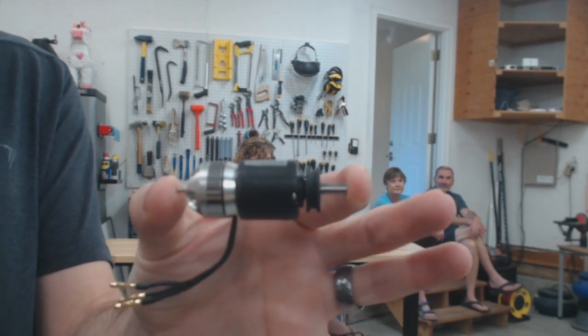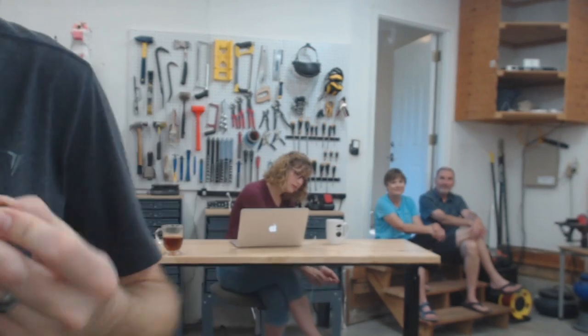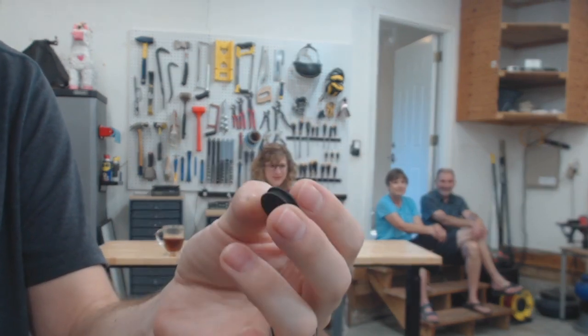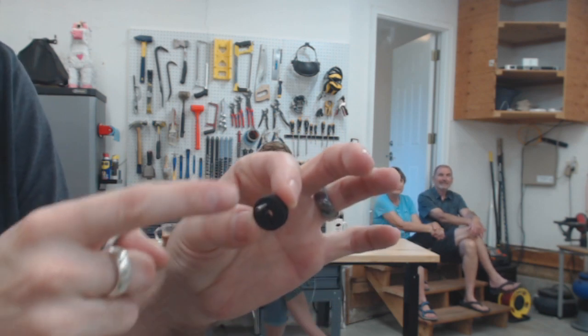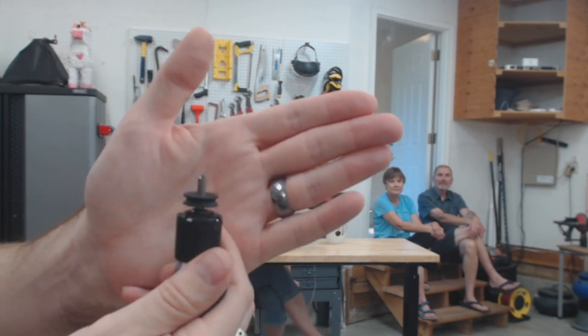2118s, 3100. So it's a 3100 kV motor, and this is just the standard planetary gearbox from ServoCity. And then these little hubs, or pulleys, these are actually custom made. I got these done through Shapeways with that new HP Jet Fusion printer. So these are pretty cool. And I have these little key pins in them, and those key into the BaneBots wheel hubs. So then I don't have to rely on the flat. I can actually drive it like that. So yeah, that's my little gearbox setup.